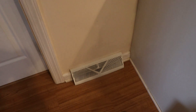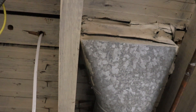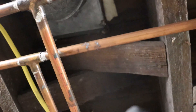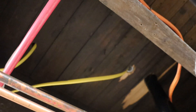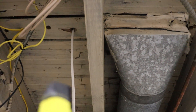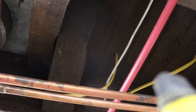Over by this room there's a vent and then I also have a light switch. Down in the basement, here's my vent and that wire that goes up to that switch. On the other side of that wall there's a vent that goes into that bedroom, so I know right after this vent there won't be a stud in the wall because these vents go in between studs. After I get past this vent I'll have about 12 or so inches to work with. Also, another reference — I have my washing machine there and that wire goes upstairs. I know that if this is my vent and that's my wire that goes up to that switch, relative to where my stairs are, it's only going to be about four feet over, and I end up by this vent. I can confirm that's the correct vent where I have some of my other wires running.